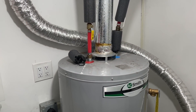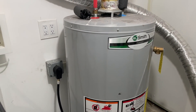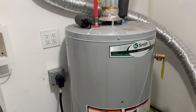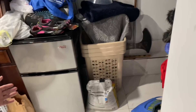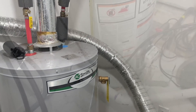The only solution to safely give you hot water is a power vented water heater — a tank — because it can vent directly outside. We can't vent into that existing thing. Alternatively, a tankless water heater which also directly vents outside — those are the only two options. It's a small box on the wall that flash-heats the water instantaneously. The gas piping is sufficient for an on-demand unit because it has a negative pressure gas valve. I'd rather go with the tankless.